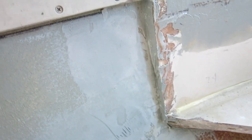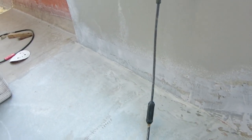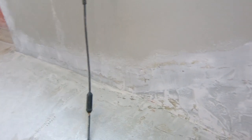And then I glassed the bottom to the hull, and I glassed the bottom to the deck, and then I put one heavy skim coat of epoxy filler over everything, and it's really rough because you got the glass poking out and nothing's really straight yet. You got differences between this and this. I'm trying to fill it all. So you put a lot of filler and you do a lot of sanding.